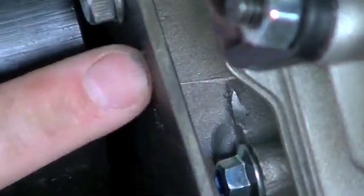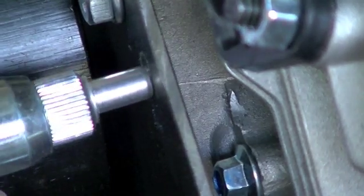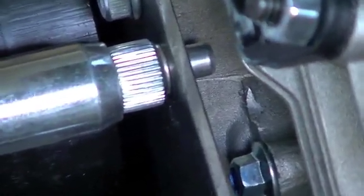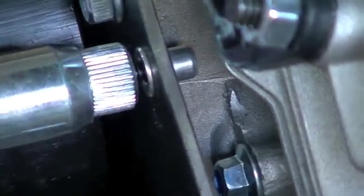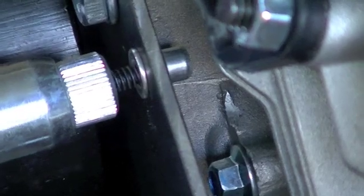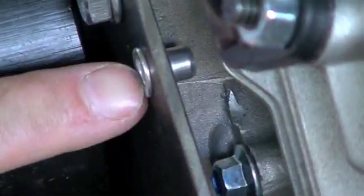I've zoomed in real tight on this little bolt hole right here. You can see I've got my riv nut attached to the riv nut tool. Here's the basic idea: you take your riv nut, just like a pop rivet, you stick it in the hole, and then you squeeze down. As you do that it sort of mushrooms out and locks into place. Then you take this — you get a little dial — and all you do is you just unscrew the tool from the riv nut. And there you go — it's locked into place, it's not going anywhere, and we have a threaded hole now to put our bolts through.